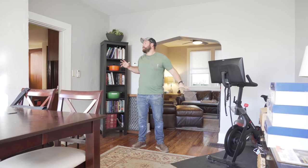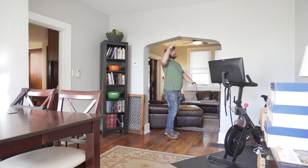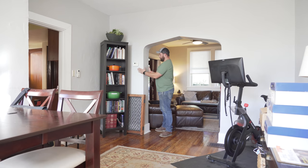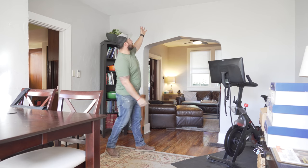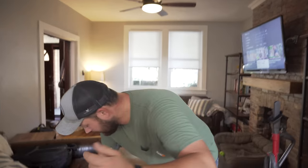We want to continue new flooring throughout the entire house, which is kind of the reason we're gonna be tearing the whole thing to pieces. My vision is to take this wall and remove it — kind of get rid of it. We've got some really tall archways that are like 10 inches thick, so we're losing a lot of floor space. We're gonna knock a couple of those down to create better egress. This is not a load-bearing wall because the floor joists run this way.